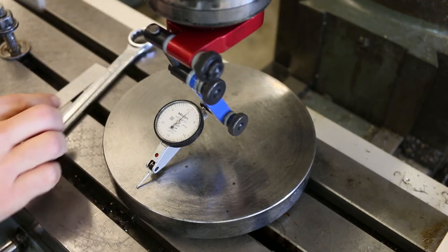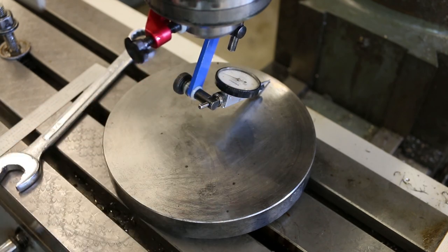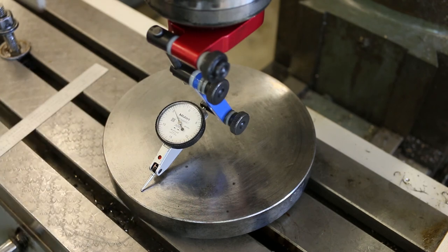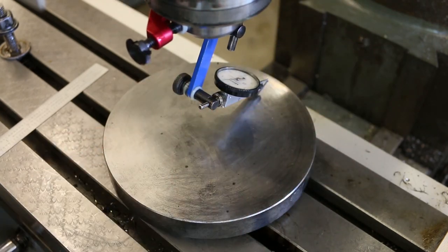Nothing fancy, no real thought involved. Just moving it always to the zero. Now I got cocked out again in this direction. Readjust it with the knee. Check what it is over here. Only 5/1000ths out. Great. Adjust it to the zero. Kind of pull back on it like that. Okay, and go back to the start position. All right, I moved away from zero, but not by very much.